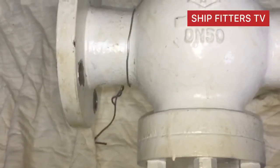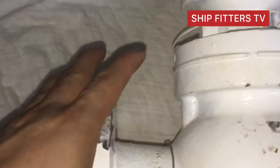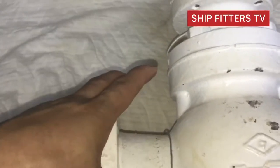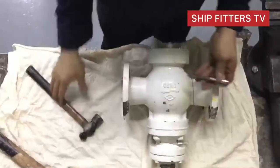So these air pressure regulators are important because different levels of pressure are needed for different types of pneumatic tools. If you try to power a slow moving tool with the same amount of pressure needed for a fast moving operation, it would likely overpower that tool.